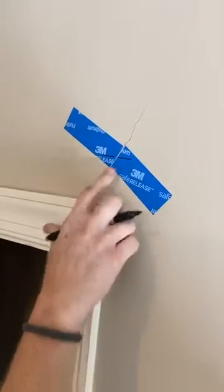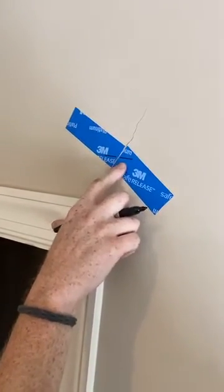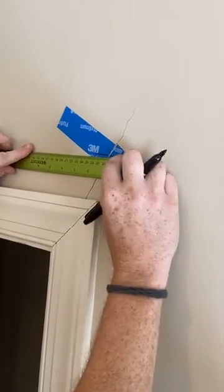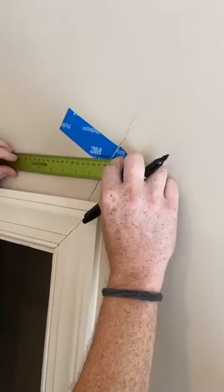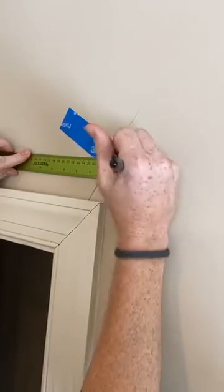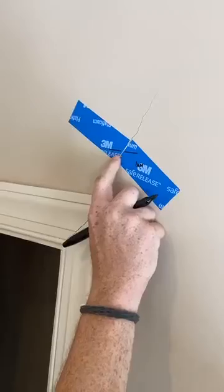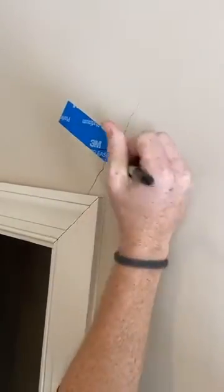And I just said crack a minute ago, but you're looking at these lines, and you can even put a tape measure up and write the measurement. What are we looking at there? We'll call that about 1 millimeter right now, and you can write that, and you can monitor the separation between these two over time. And you can even put the date. I don't know the date. That's unfortunate. But you could put the date there.